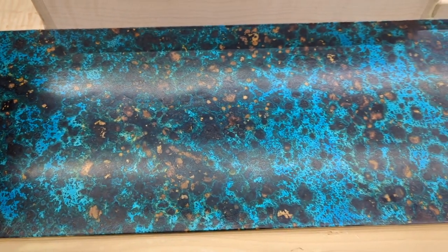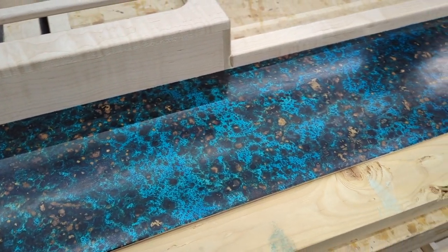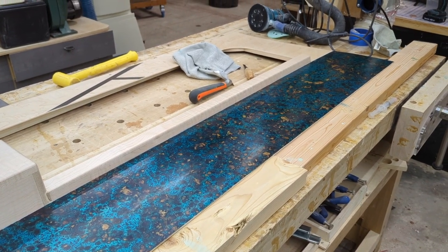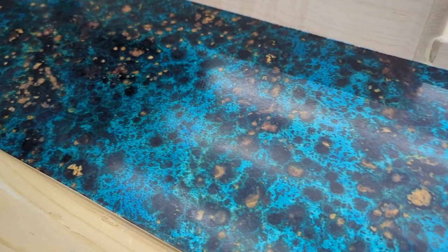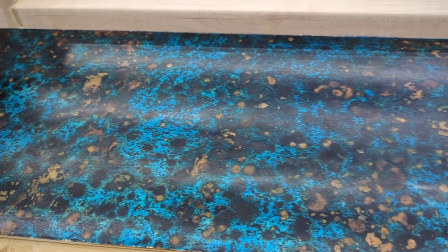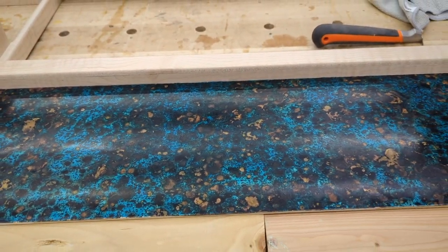So if you're still following along — would I do this again? I think I would. The two things I really needed to know before I started are: first, the patina is a lot more fragile than I expected — when someone tells me I have a lacquer finish on something, I expect some amount of protection, and it was way more fragile than I expected in its original state. Second, the next best thing to do right off the bat is just use some kind of spray lacquer, apply three to five coats and call it good. Pretty frustrating, but in the end I'm pretty happy with this end product. Thanks for watching, guys.